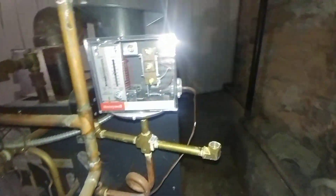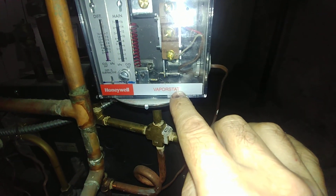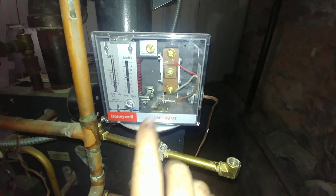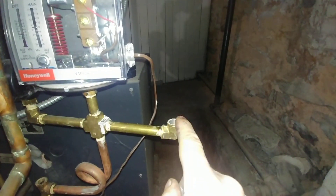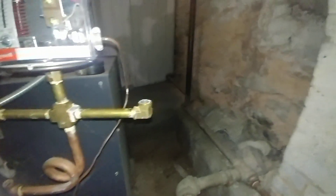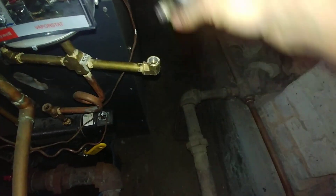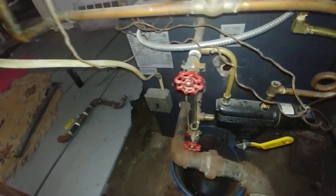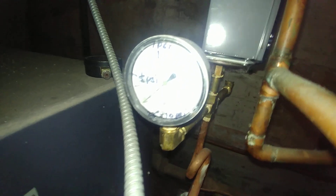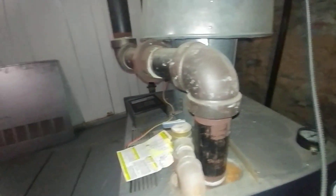We piped in a vaporstat — there, you can catch a glimpse of the word 'vapor.' It's one of the non-mercury type, which is dubious, but it appears to work. This is where the 30-pound gauge would normally go — I've removed it. We blow into here to make sure that the pigtail is clear, and we've added a low-pressure gauge so that we can determine what pressures the system really operates at.